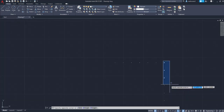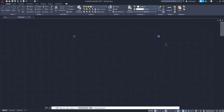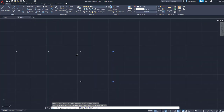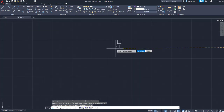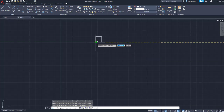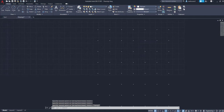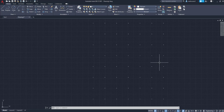So for this first little bit, we're going to grab this right here — this is going to be one side of the wall, and this is going to be the other. We're going to copy this and go all the way down. The building columns are going to be all uniform throughout the entire building, all 54 feet center to center from each other. So we're just copying it down to create a square of building columns. As you can see, I now have a grid pattern of building columns, and this will be the existing footprint for our current warehouse.